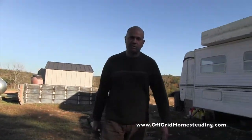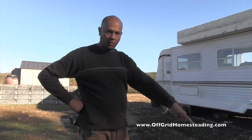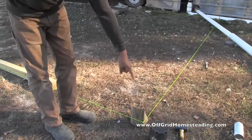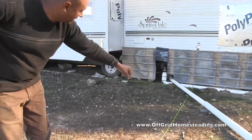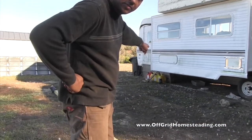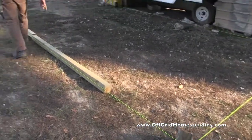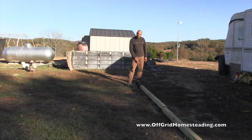So what we did to get your square is, once you measure your 14 feet from edge to edge — from this corner post to that corner post — it's supposed to be 14 feet, the length of our board. And then from that post to our other post down at the other end, that's supposed to be 20 feet, and then from here, this post, to here, it's supposed to be 20 feet.